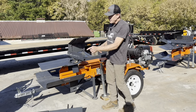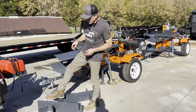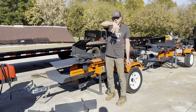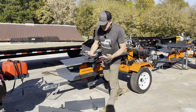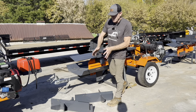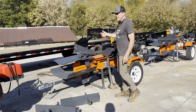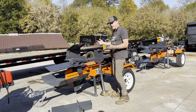But if you want to get the most performance, the 6-way star wedge, even though it's splitting 6 ways, because it has more relief to it than a box wedge. If you look at a box wedge, you'll see the flights are almost all in line. So there's not a lot of relief as the pieces go through. But the way the 6-way is, you've got about a 45 degree angle on each. So as the wood splits, as it goes through, it's free to twist and move a little bit, and it makes it easier to go through. So it actually can push more difficult wood through that 6-way than it can through this 4-way. The only thing you get with the box wedge is life is easy. You get it to the splitter and it does the work.